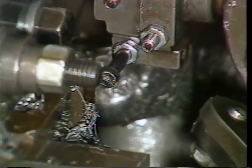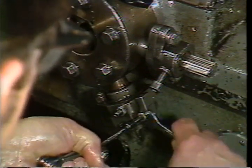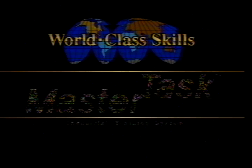Adjust the bump screw out until it almost contacts the riser block. Start the machine and stop it after the part has been cut off — you should have little or no recessing on the first part. Adjust the bump screw out slightly until the proper recess is achieved. This completes your training tape on the recessing operation. You may watch this lesson as many times as you need; when finished, return to the operator booklet for your next step.